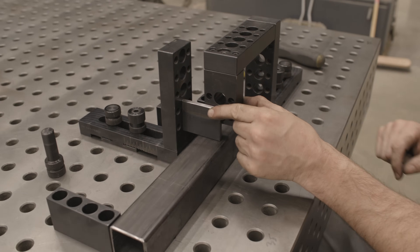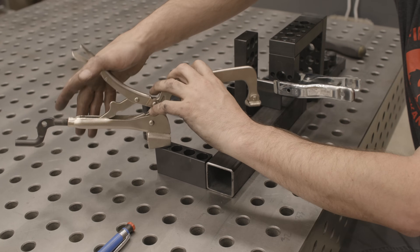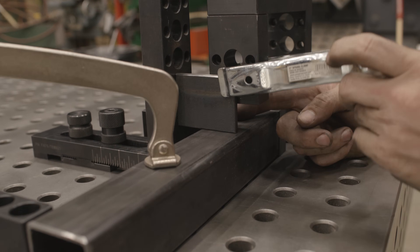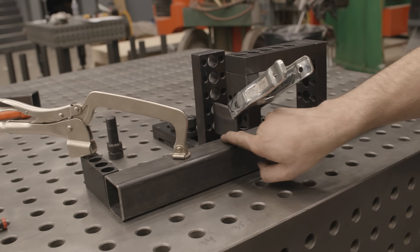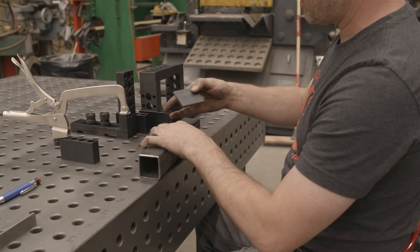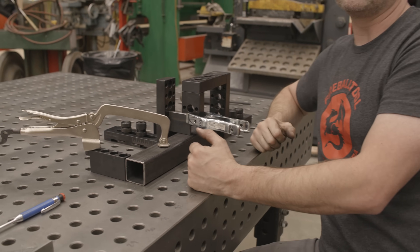Now I have an end stop this way, it's nice and square. Put the tab up against that stop — look at that. Now if this was a production run I'd get myself a fast clamp or something like this to hold it there, and we're basically done. I'd put another clamp on him like this, then locate the tube so he doesn't get squirrely. Everything's secured down pretty good. If you notice, I can weld right there with no obstructions — I can weld right through here. Then when I'm ready — boom — pull this out, pop this up, the whole assembly slides out, part is done, and everything is hanging out in the open. Time to do it again — no layout, no clamp. How cool is that?